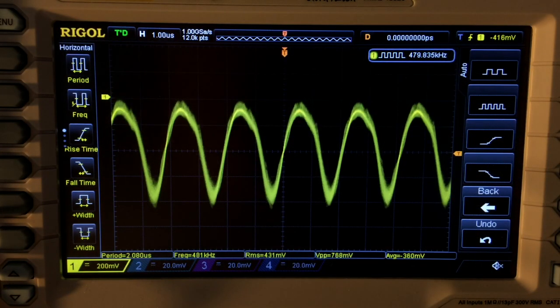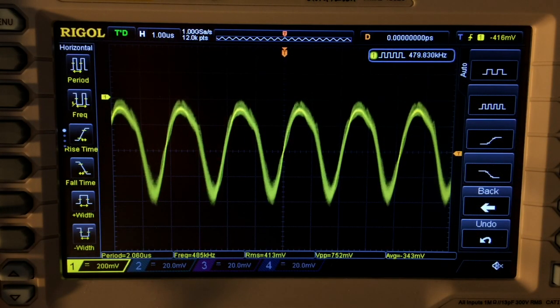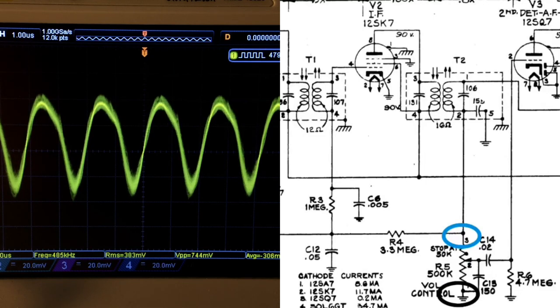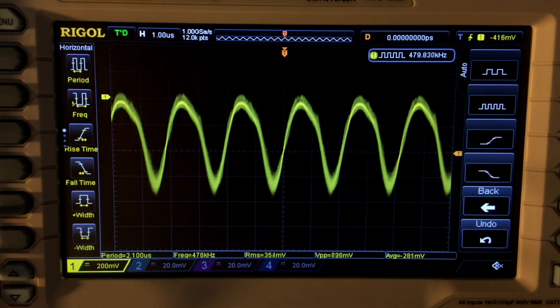A little troubleshooting here on the automatic volume control. I've got my oscilloscope hooked up here to the high side of the volume control. You can see where I'm connected there on the schematic itself, and you'll notice the waveform that I'm seeing. Let me bring the amplitude up here and let's just see what happens.